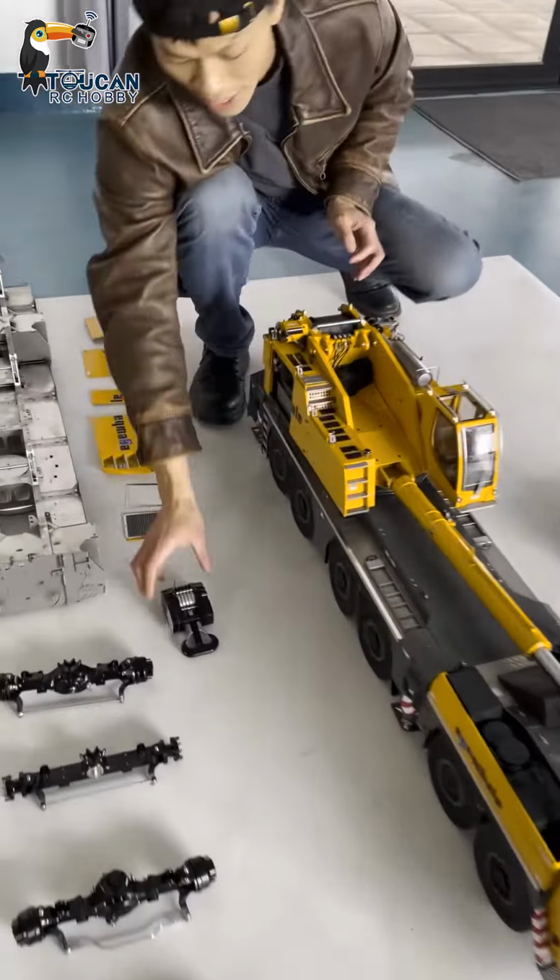It is all CNC cabin and shell cover. The other parts are all steel. On the chassis you see this cabin here for operating the crane. It is elevated with a hydraulic control cylinder under there, with one separate oil channel for up and down. When you are lifting, you can see the angle on the top. That's the rotation motor and gearbox, with strong steel gears and the big rotation gear on there.